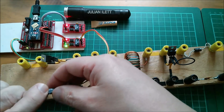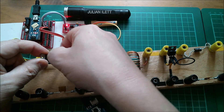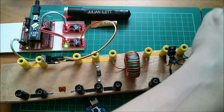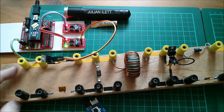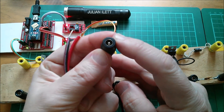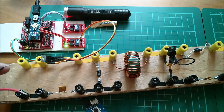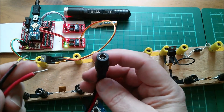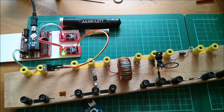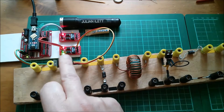I need ground which is yellow onto source of the MOSFET - oh I think it's that way around actually. It shouldn't blow the MOSFET up if you get this wrong. The way I'm going to check this is just put this bulb on the output. I've found one of these quite high current 2.1 millimeter female DC jacks to bare ends. If I put a couple of ring terminals or spade terminals on that I can just plug my 12 volts from my solar system in there and see whether this lamp is brightness controllable with this pot on that first driver.